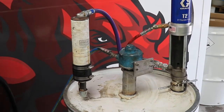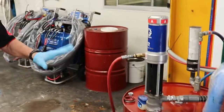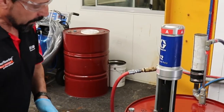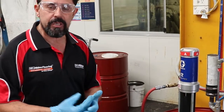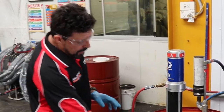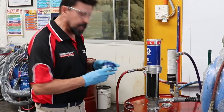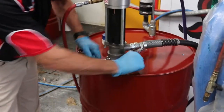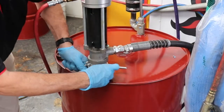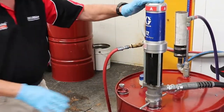With the resin, we just keep it stirring. Now let me show you the isocyanate, or iso, in the red drum. Once the iso comes in contact with moisture, it crystallises. So any threads you may be using throughout the process need to have grease on them. We generally use Vaseline — it's cheap and easy to apply. When we screw the pump on, we just smear the thread with grease. That way when you come to take it off and undo the thread for the transfer pump, it'll be nice and easy and a quick turnaround.